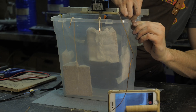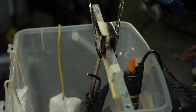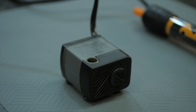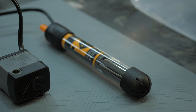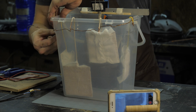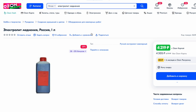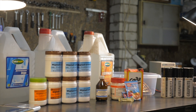To make the coating process even faster and more uniform, in the bath in addition to the pot and anode plates you can place a heater and a small water pump from an aquarium. The heater will warm the water and the pump will constantly mix it. After installing all the components, you can estimate how much electrolyte you need.